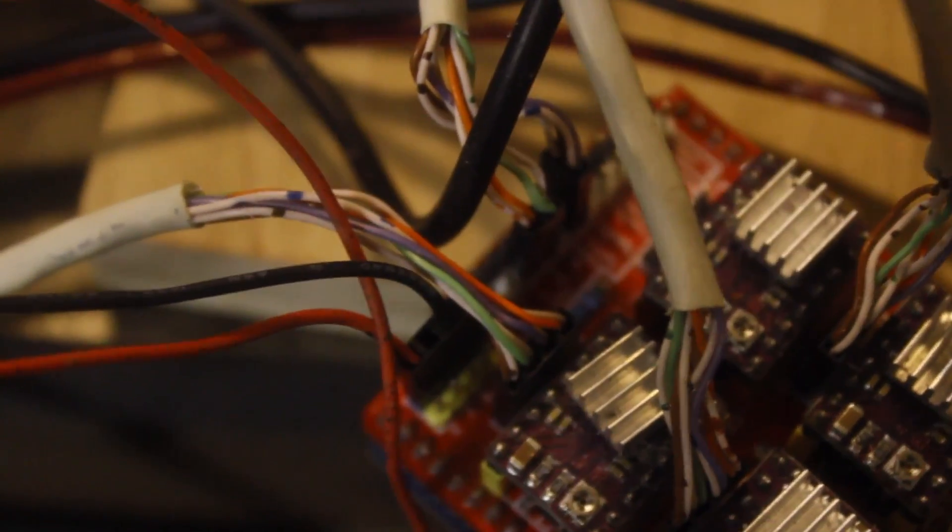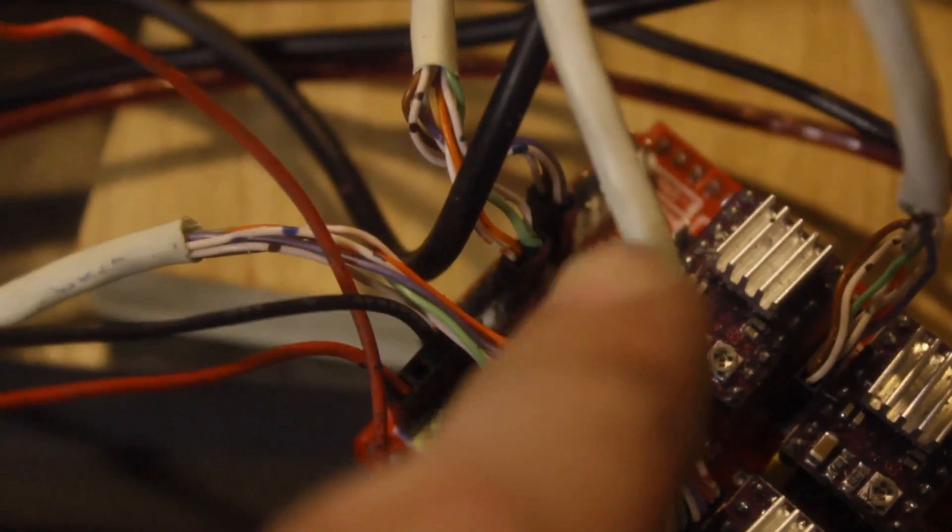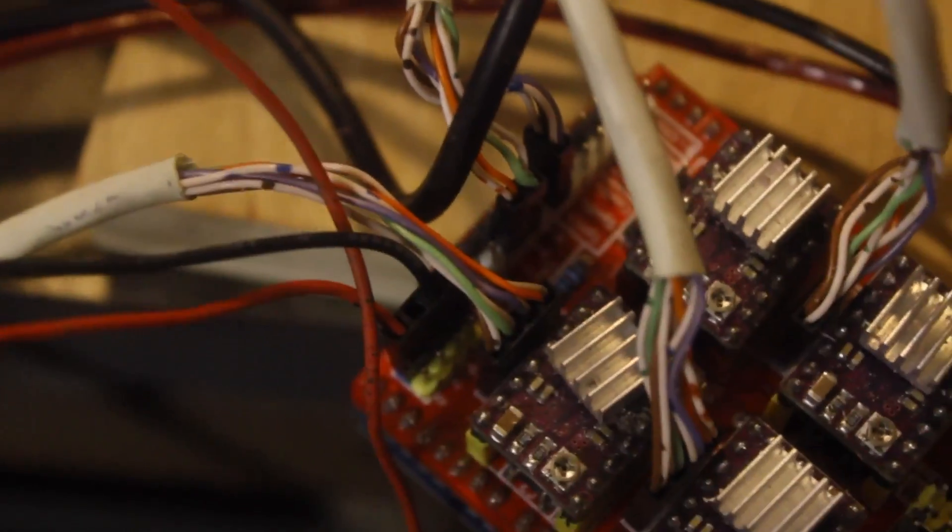So if you're having trouble with your Z axis limit, you'll want to use spindle enable versus the Z axis if you're on a later version of GRBL. For some reason they swapped pin 11 and 12 in the Arduino, and the result is you have to swap Z axis for spindle enable.